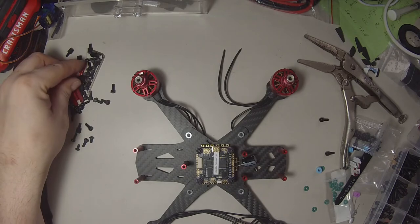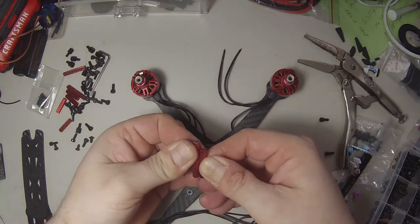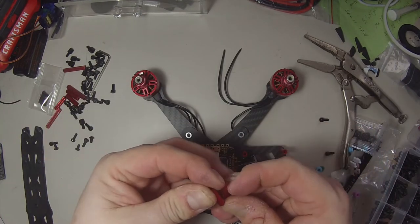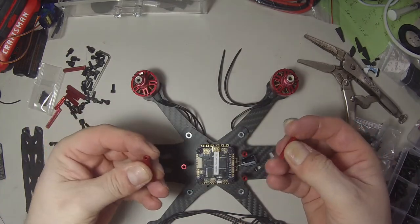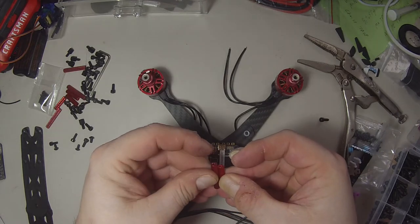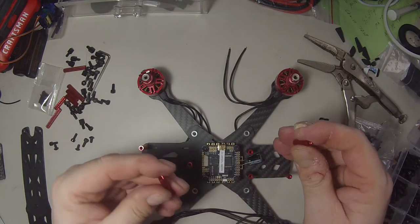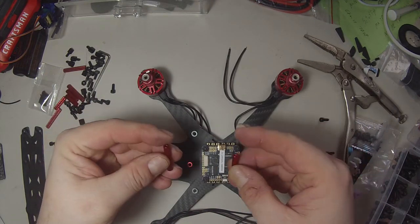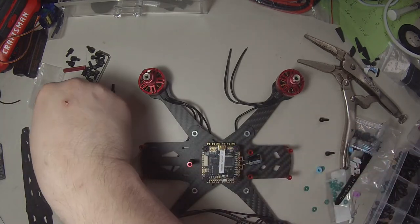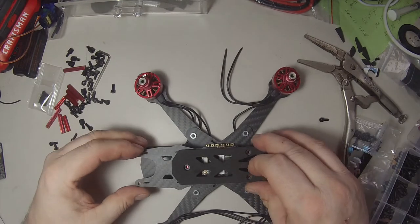That gives us enough room with nylon nuts on top to hold them down — a nice slammed profile compared to the larger standoffs. The front plate drops and the back plate goes up, so there's a height difference front to back. I ended up using 20mm standoffs on the back and the shorter ones from the kit on the front with nylon nuts to make up the height difference, and that makes up the same height.